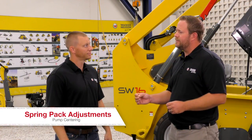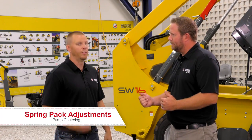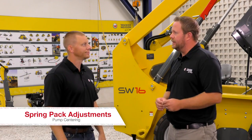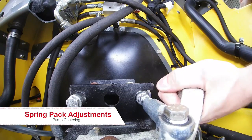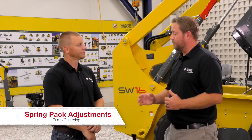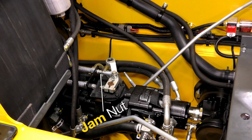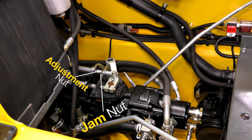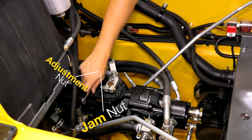Is there a specification that we need to follow, or is this just a visual check? It's kind of a visual and a touch feel with the pintle itself. So we shouldn't have any slop in that spring pack between the brackets — correct? Correct. We've determined now that we do indeed have slop or clearance in the spring pack between those brackets. How do we adjust that out? The first step is you're going to loosen the jam nut, and second you're going to take the adjustment nut and back it off, making sure that your contact between the bushing, the spring, and the bracket is tight.